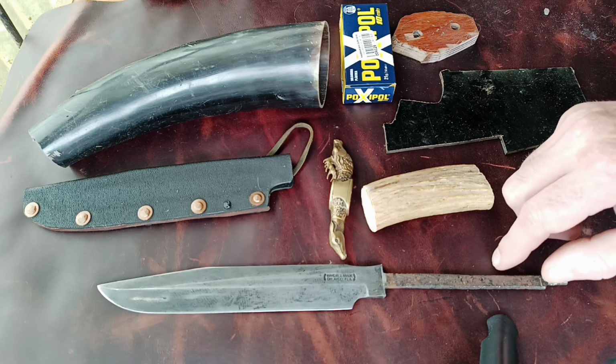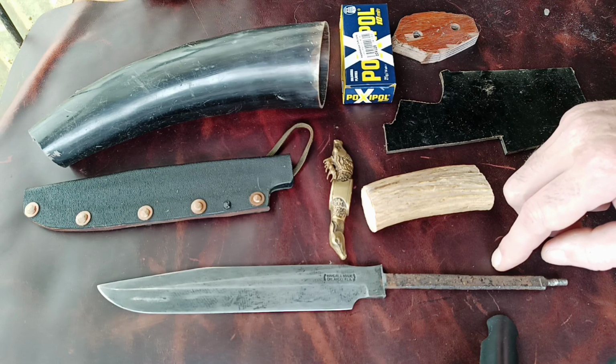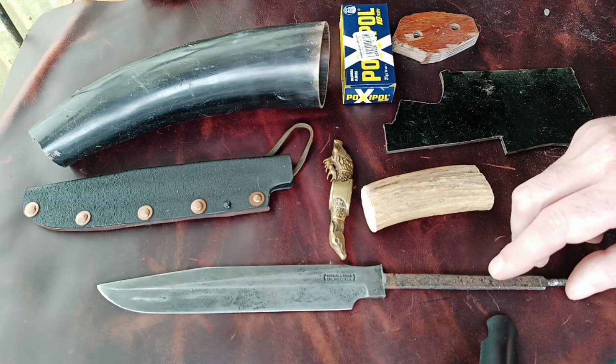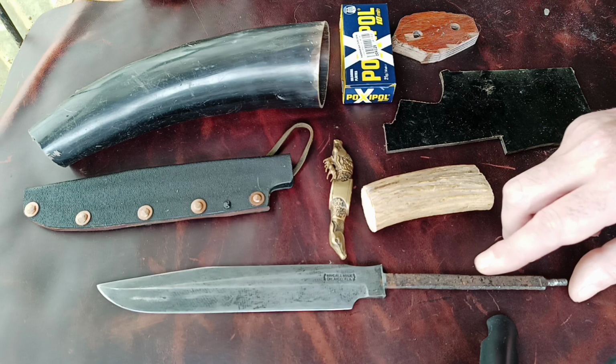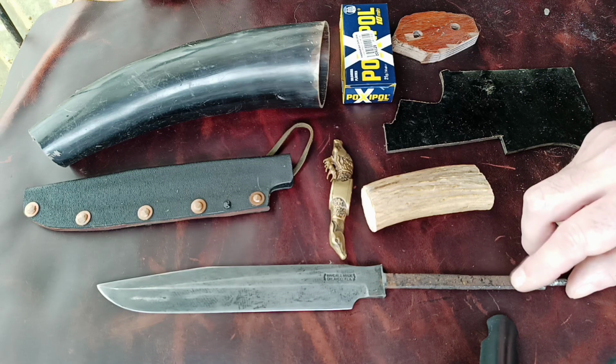I will be cutting the tang on this. This is the last stop for this blade. And the main goal is to put it in something secure that it will not rust. I'll be using either a vinegar or a Coke solution to neutralize all of the rust that's going on there, maybe stop the process, hopefully. And then grinding it down so it's clear, clean metal.